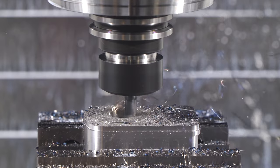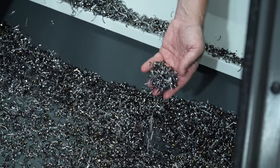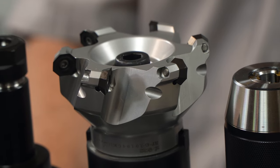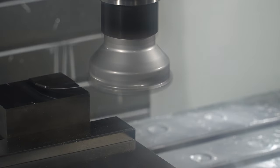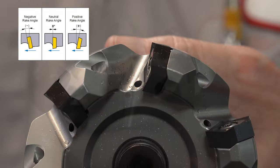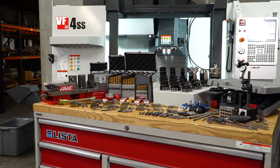For steels and stainless steels, this positive octagon insert is going to get the job done. The 45-degree lead angles on these inserts will keep our axial and radial cutting forces well balanced, and with eight cutting edges per insert, they're an economical choice. These HMP35 grade inserts can handle extremely high temperatures without breaking a sweat, even cutting dry. If we didn't have inserts that could handle these high temperatures, we'd have to run these face mills really slow. Have you ever really looked at your chips? Most of the heat from milling is pulled out with those chips, and we can generally tell how hot things are running based on their color. These chips are running at maybe 480 to 530 degrees Fahrenheit — 250 to 275 Celsius — because the color is moving from brown to purple. There is no fat in this kit; we're going to use everything that we put on our list.